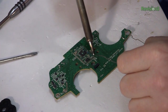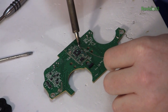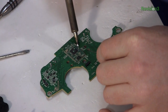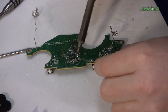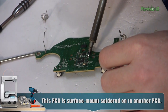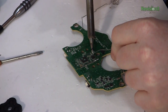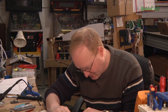This is a PCB that's been surface mount soldered, but it actually has these vias that it uses to attach to the board. So I'm going to remove it. Hopefully I don't wreck it. My plan here is to first reflow on some more solder. I'm going to use this knife to wedge an angle, slowly move it up.